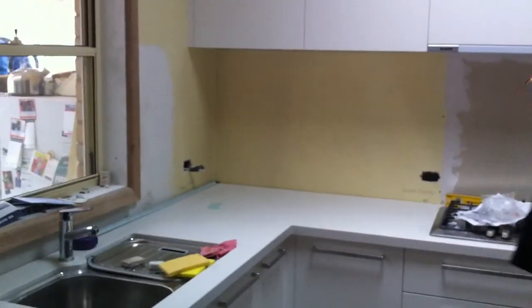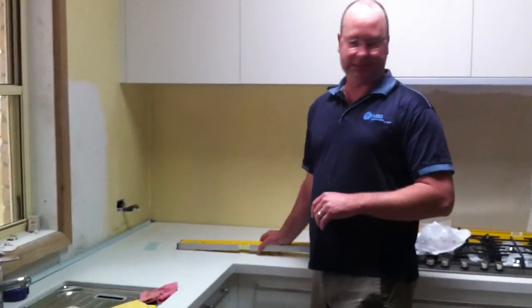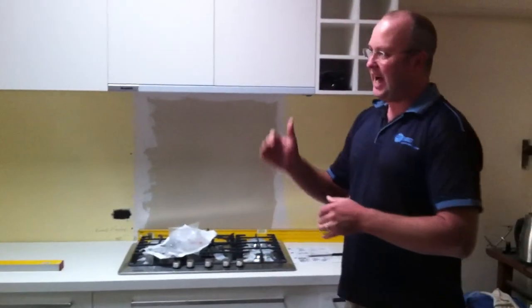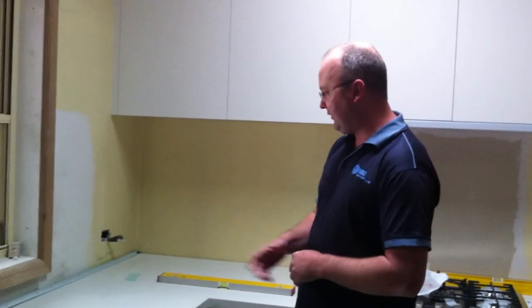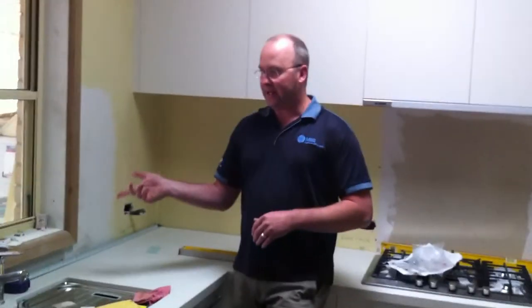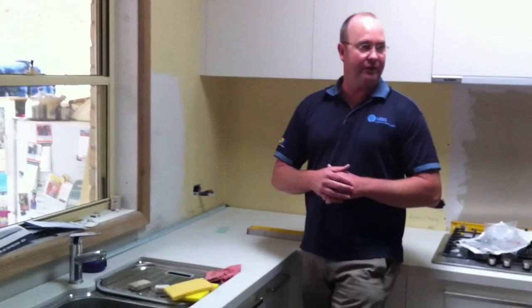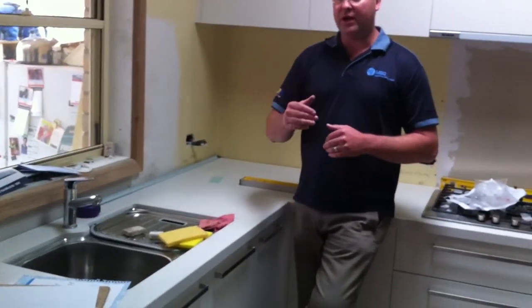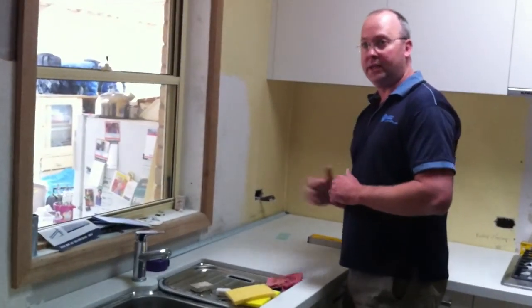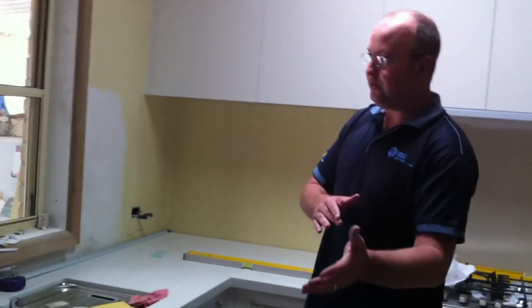Correct. Now, the other thing you'll have to work out, and would be advice from myself or Marvin, is what can and can't be done. The rule of thumb that you can work off is half the body of glass as an aspect ratio. So when you've got 700 here, you don't want to remove any more than 350. The reason being is that when it's toughening, when it goes through the toughener, we heat it up to about 650 degrees Celsius, then cool it rapidly. And in the chiller, the skinny area here twists and warps and blows up. We lose the whole panel. The toughener's down for 48 hours. That's a nightmare. So we know the parameters on what can and can't be done. It can't have more than 350 cut in it. Half the aspect ratio, whatever the size is. So if it's a metre, you want 500 body. Alright, so here, obviously that's not even 100. As soon as the drawings go to us, we'll just flip them straight back.